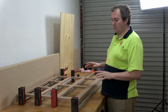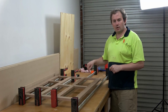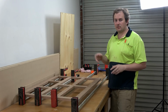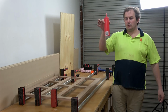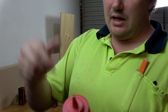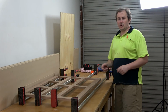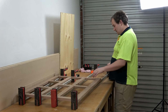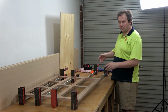So you get a fair amount of open time with this glue because so long as you get the glue into the hole and then the tenon into that hole again on top of it, you actually seal the glue up from the atmosphere, and it takes a little bit more time to set. For example, I leave the glue in these glue bottles and there's a hole in the top, so technically air can get in and out of that, but I can leave that glue bottle there for an entire year and it still won't go off. So that doesn't mean you can leave this for an entire year, like an extra few minutes, not like hours.